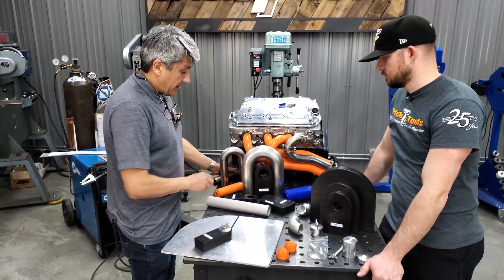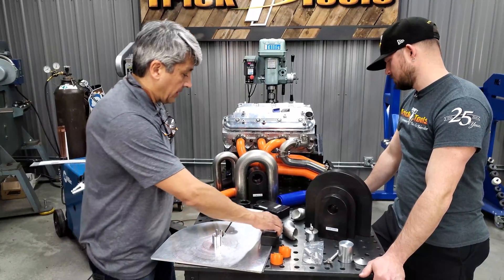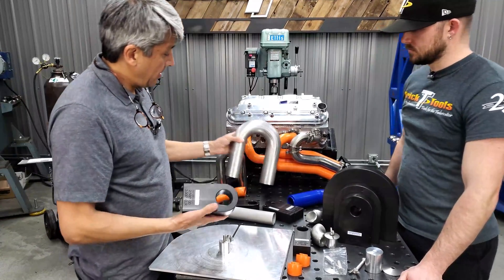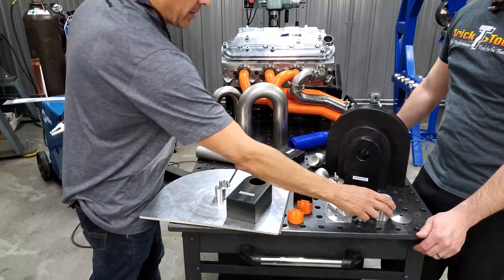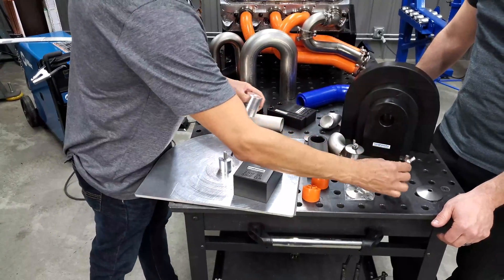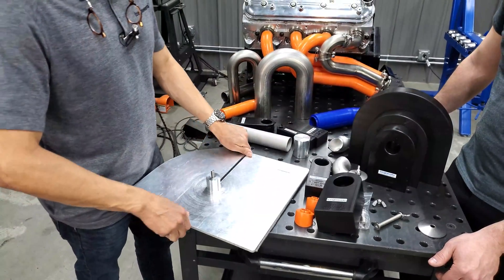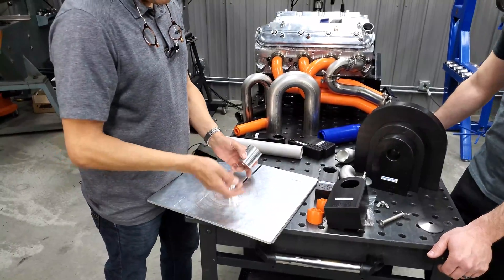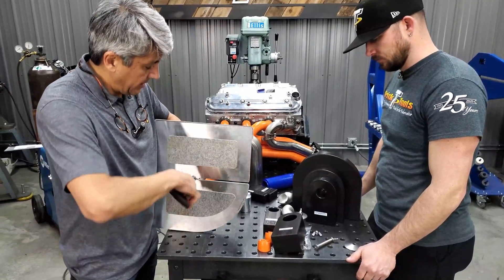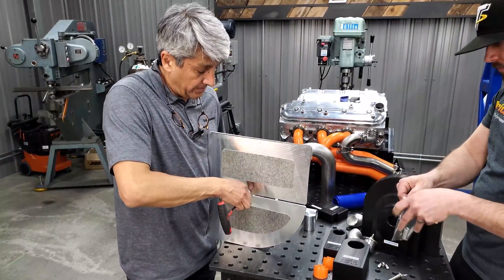If we need to switch from the EH series to the full exhaust FE series, the spacers are bigger because we're using larger diameters, so we'll require a different stud that is taller, along with a longer bolt. The process is simply unscrewing the current stud from the back and replacing it with the new taller one with the longer bolt. It's a very quick conversion.